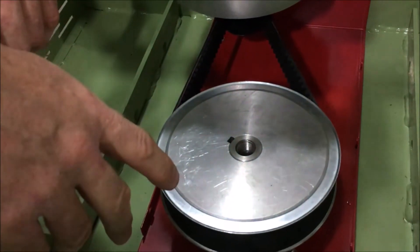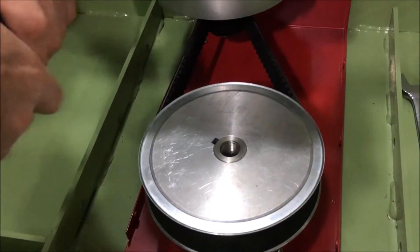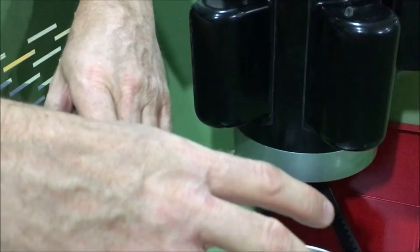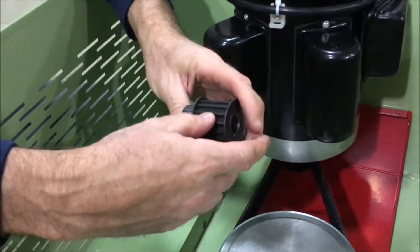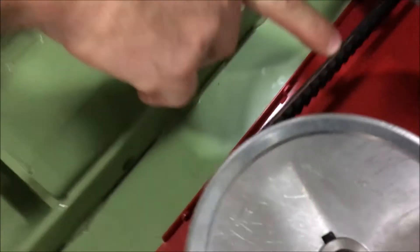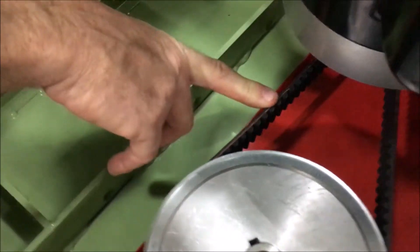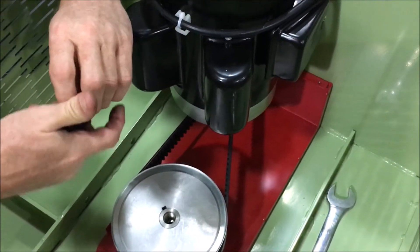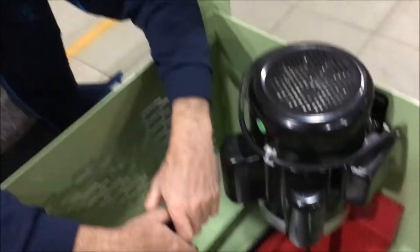It's really easy to put guarding around it and make it easy to maintain. The nice thing about a timing pulley is that it's also very smooth running — a V-belt can take a set and feel kind of pulse-y, like boom boom boom, but a timing pulley won't do that. You'll see on a lot of our machines we use this style — it's called a curved tooth. The belt has rounded teeth on it. They also make them with square teeth, which are cheaper but noisier. We want our stuff to be quieter and better, and we can offer this and still make a great flat lap that's less expensive than what's on the market right now.